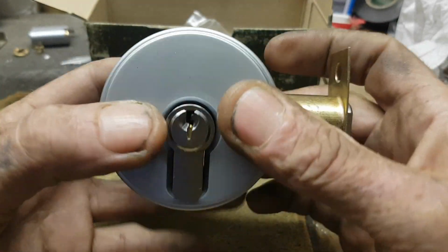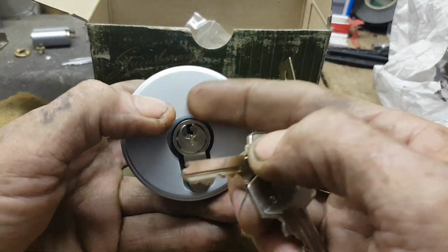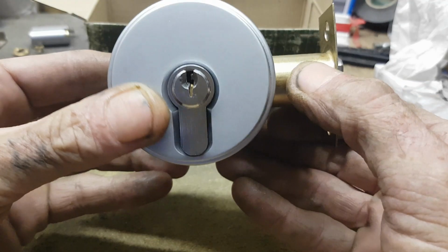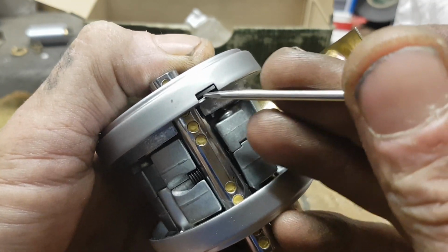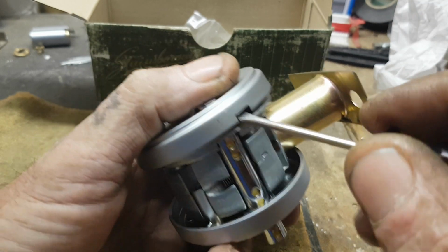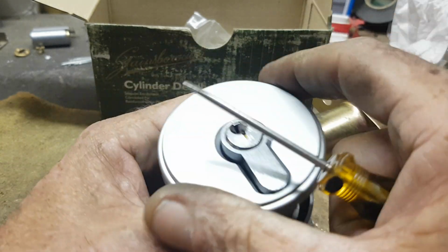Okay. Now, if you ever get to the point where you need to remove this to tighten up the deadbolt, or remove the cylinder to rekey or exchange over the cylinders, whatever, you've got to get that escutcheon off. What you'll find, this is how it would lay or be placed on the door. At the bottom, you'll see a little cavity there. Like I said, this guy, he didn't realise, but he thought, oh, okay, I'll get in there and keep doing that, or it'll come off. But he didn't realise it wasn't going to come off. All he was doing is damaging it, bending it.